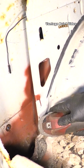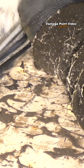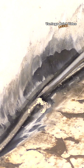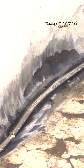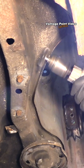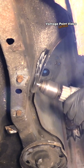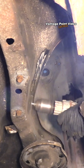I like the idea that this could have the effect of having a rear strut brace. Again, a lot of sealant in here, and I'm using the technique that I did on the bulkhead in sections and also on those bits of the sill. I'll do a couple of light little welds to burn out the last bit of the sealant in the area that I'm going to weld, and then I'll do a nice solid continuous weld in a stitch over those.